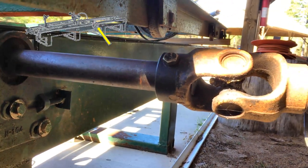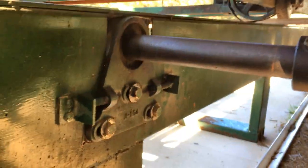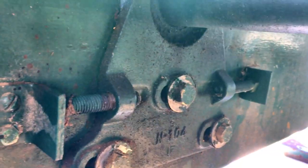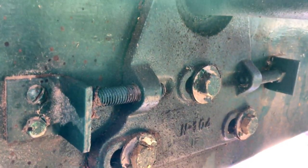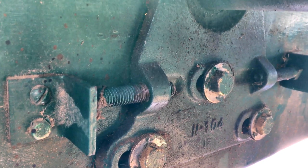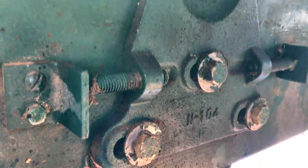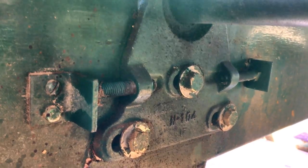Okay, what you're looking at here is the PTO where it meets the blade shaft. And right under here is another adjustment. And this sets the blade parallel to the tracks. Or you can think of it also as setting the blade with a slight lead into the log, kind of like a toe is on the front tires of a vehicle. So what I've done is adjusted that right there using these little bolts